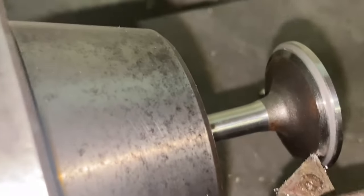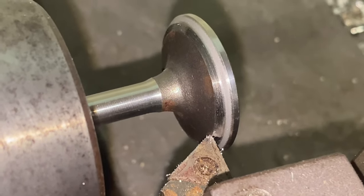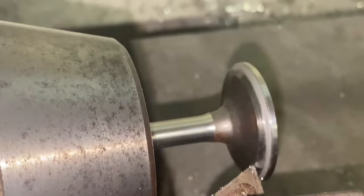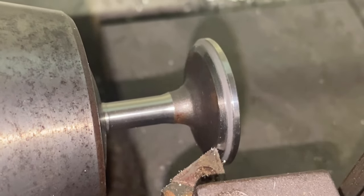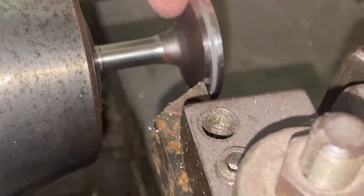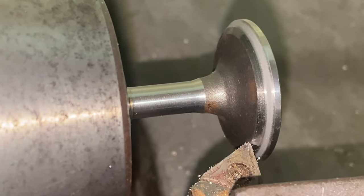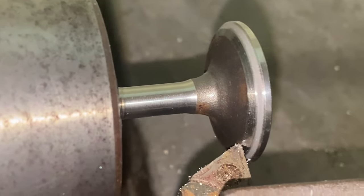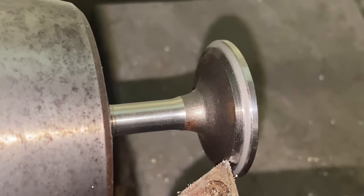That's just a back cut for that angle. We could do the same thing if we needed to face these valves at a 45 degree angle — we could set the compound on the lathe at 45 degrees. This collet chuck runs out less than one tenth of a thousandths full indicator reading, so it's very concentric to the stem of the valve. Because of the roughness from the carbide cutter, they run concentric to the valve. Once you lap it in, even if it was on the face, it would work out just fine without the use of a tool post grinder.